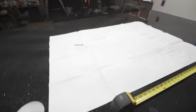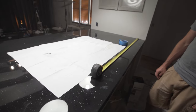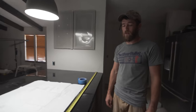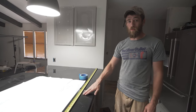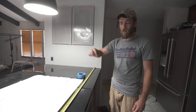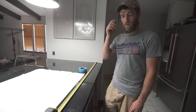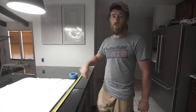Nice. So we're gonna cut into the epoxy countertop here. And I think we have to run tape because the epoxy isn't fully cured. So we have to run tape around the border. Actually, the main reason I use tape is twofold. Especially if you're doing a newer or a cured countertop, it tends to chip. So the tape will help seal that, so you don't get chips off of it when you're cutting it. And for number two, this is a black countertop and it's really hard to see lines on it. So I'll put tape down and then draw my lines over the top of the tape.